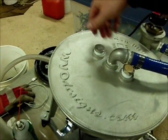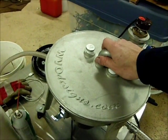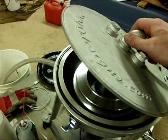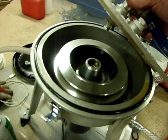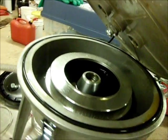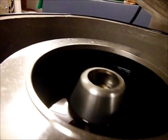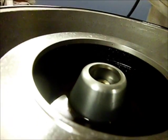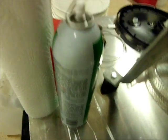We've slowed down to 490 RPM. I'm just going to pull the lid here — it's kind of warm right here because the heater heats up the oil before it goes in. We can see it's rotating, and we're just going to slow it right down and watch it drain. That's all the gooey stuff. You can see on the inside of the centrifuge, right on the sides, all this trash — really dark stuff. The only way to get that off is with brake cleaner.